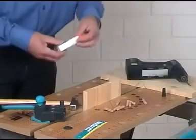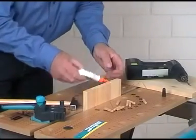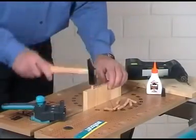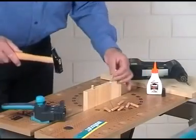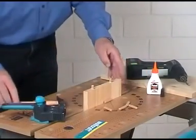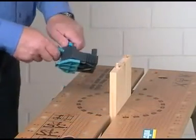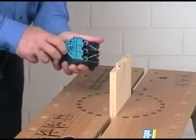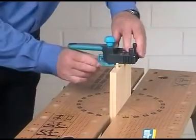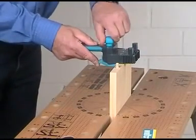If you have drilled all edge butts, the next step is to glue the dowels. Only like this, the Dowel Master can copy the counter holes with the aid of guide groove to the other board. Please unscrew the fixing bolt and draw back the stop a little bit for adjusting the stop of the Dowel Master on the dowel at the edge butt. Put the Dowel Master with the 8 mm drilling bush on the dowel and move the stop firmly against the board. Then fix it again with the fixing bolt.